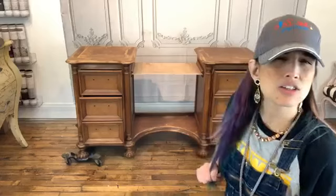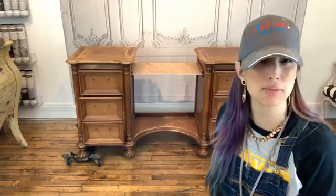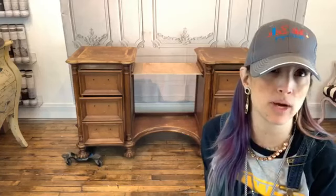We're working on the free vanity, and so far this piece is in really good condition — I'm pleasantly surprised. It had a bunch of surface scratches, not too bad. I sanded those out. This piece is oak, and oak can bleed sometimes, so I'm playing it safe. I went ahead and applied two coats of clear Boss, which is a primer from Dixie Belle Paint Company. You use Boss when you're worried about tannins bleeding through, or smells, odors, or stains. I'm all ready to paint.